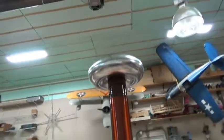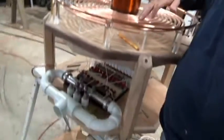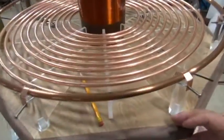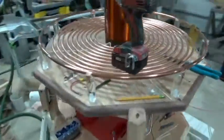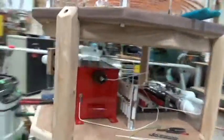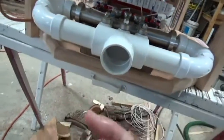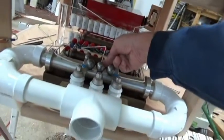This is a regular spark gap Tesla coil. I'm going to stand next to it so you can see how big this thing is. It's three feet off the floor, as you can see by my waist. It's not very tall — it's going to be maybe four or five feet tall when I get done. There's my transformer right there, my MMC right there, my Terry filter, my spark gap right in here, and my safety gap right here. We're going to pull a vacuum with a vacuum cleaner through to cool the spark gap and to keep the ozone down.